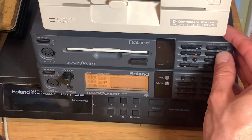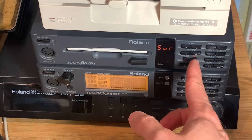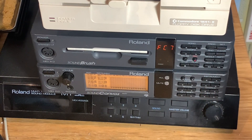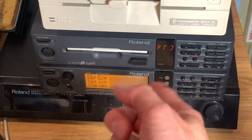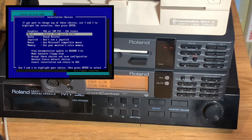There are some files on here I want to delete, so we hold down the Clear button and insert the disc. It says 'SIR' — not sure what that means — but pressing the Record button will format the disc, shown by this symbol and the spinning motion of the two other LEDs. This takes a couple of seconds, but very quickly the disc will be initialized to 720 kilobytes and ready to record.